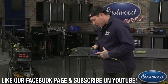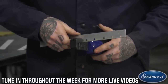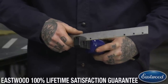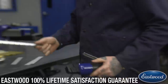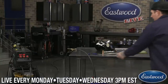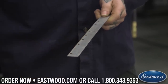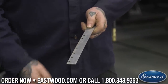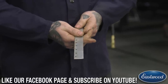So I'm going to do a handful in here to show you guys setting up the machine. You can see how quick you can punch a panel — we probably would have only gotten through one or two holes if we were drilling. The other thing that's really cool is it doesn't leave any kind of burrs on the backside — it's nice and smooth. It just punches a hole kind of like a paper hole puncher would. Takes that little circle out and we're good to go — we don't have to clean that up with a grinder or a file like you would with traditional drilling.